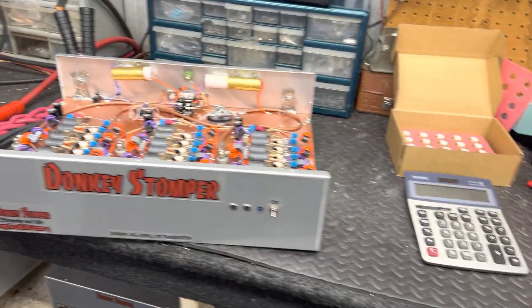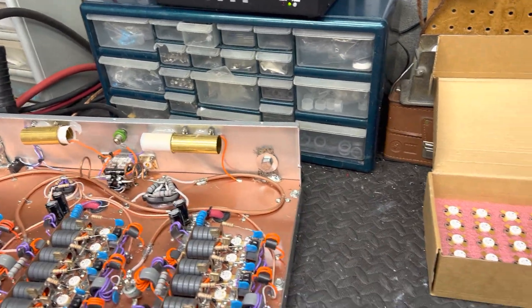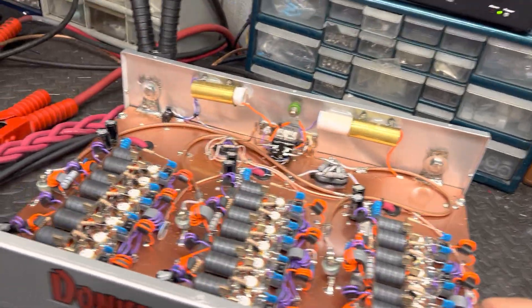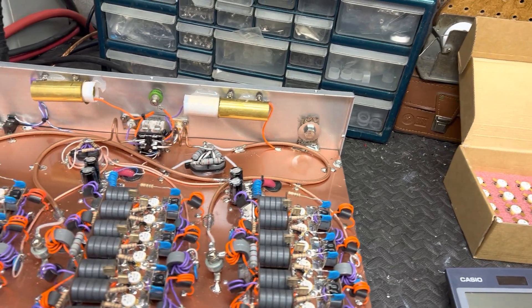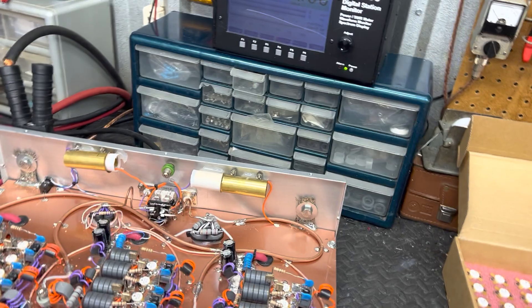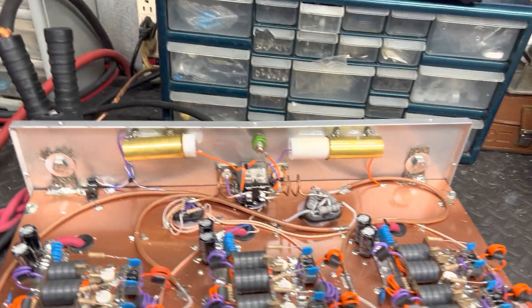Look here guys — if you want to dead-key this 24-pill, it's 25 watts per output transistor. So 24 times 25 equals 600 watts max, and that's pushing it. I would run mine at about 400, but 600-some is the max. That's your max key-out. What do you put in? That depends on your driver, your antenna, your coax, your SWR, and your watt meter — everybody's gonna be different.